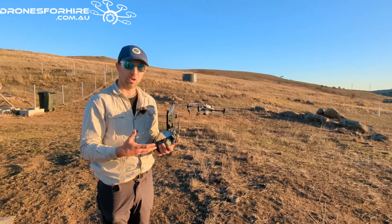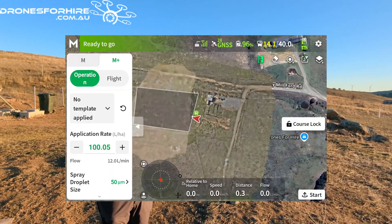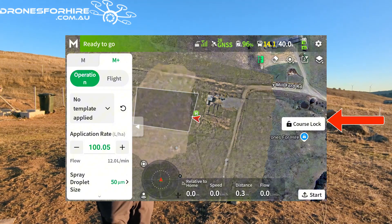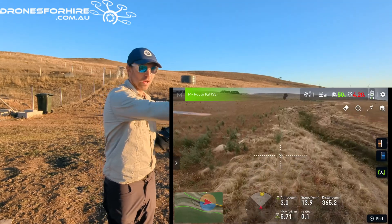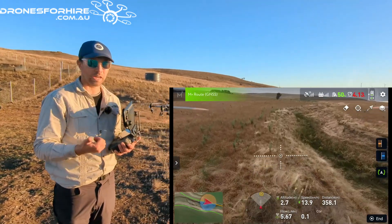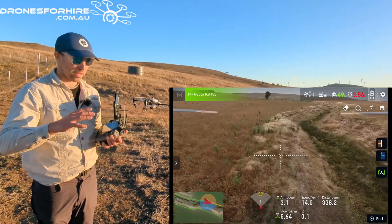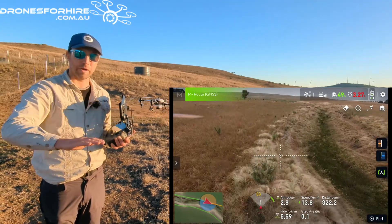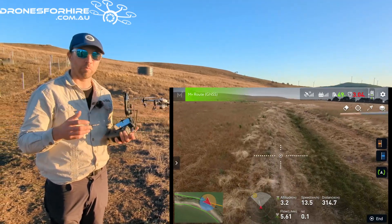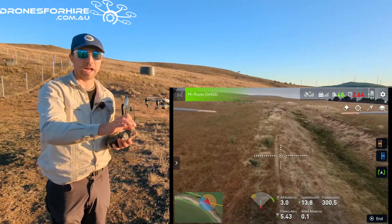You've got complete control. You can turn on and off a thing called Course Lock. Course Lock means it will maintain the heading. If you turn that off you can do a perfect rate-controlled run along a riverbank, a dam, a contour line, a gully, anything like that. The issue with that is you can't use the GPS to come back across in a freeform manner - you've got to manually pilot it to match that other run.